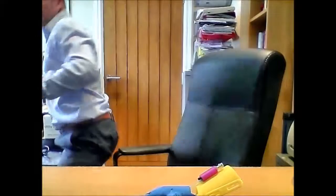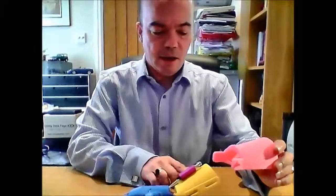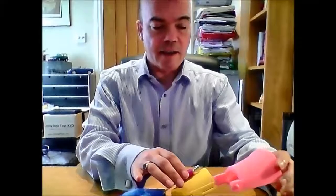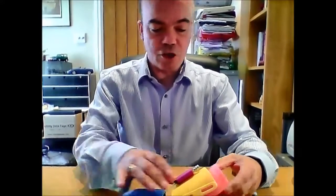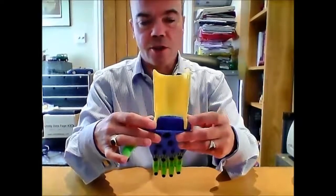The wrist area was done from a jig, like I have here. That was thermoformed by printing it out flat, putting it into a bowl of hot water, and then when it reached the correct temperature it was formed around the jig, making sure that the lugs were in the correct position to attach to the palm.